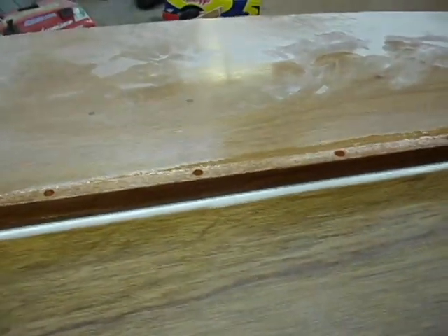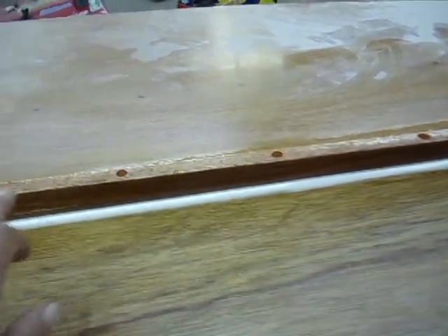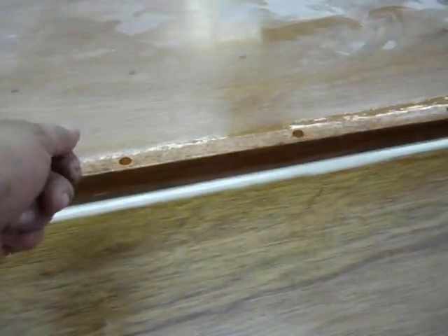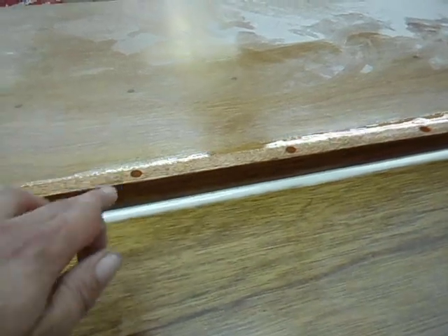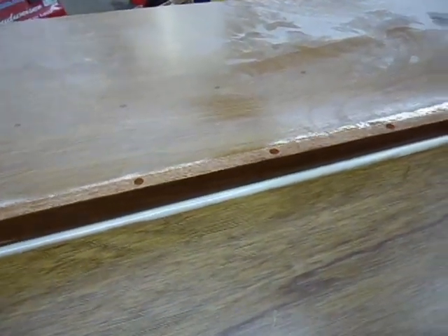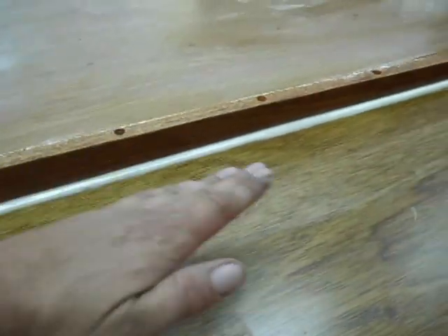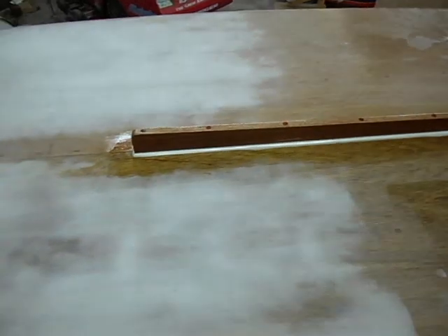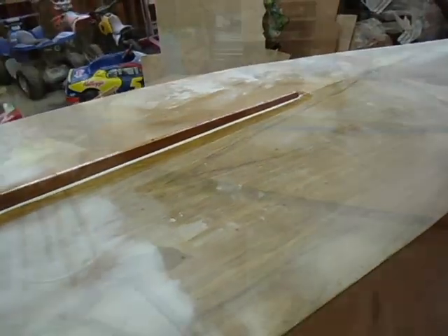Now it's coated in its first epoxy encapsulation. I have mahogany plugs in all of the holes, and as added security, before putting the plugs in I mixed up the encapsulation epoxy and poured some down each hole so it covered the head of each screw about an eighth inch — to seal it so that if any water ever got into the hole it couldn't bypass that epoxy and leak around the screw. Then I epoxied all the plugs and shoved them in. Today I came back, cut them all off, sanded everything smooth, and put on a coat of epoxy. I'll let it cure seven or eight hours, apply another coat, hit it with light sandpaper, and we'll be ready for bottom paint.